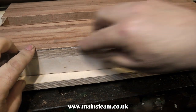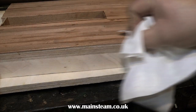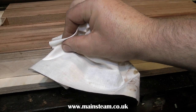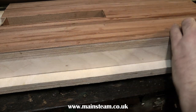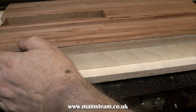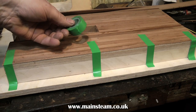This was a fiddly bit to do. At each side, I needed to put a very thin piece of mahogany on. Sticking on long, thin pieces of mahogany is much easier with cyano because it grabs so much more quickly, and I needed some help to hold the piece in position until the PVA had grabbed. Normally, I would use masking tape for this job, but I couldn't find the masking tape when I was making the video, so I used some electrical tape. It's not as good as masking tape because it doesn't stick as well to the wood parts, but it did the job for this.